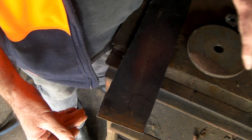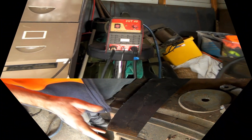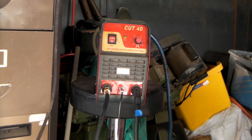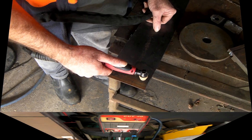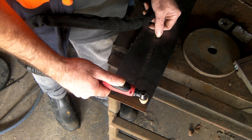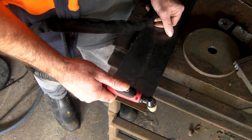You might find we have difficulties with three quarter inch, bearing in mind we're only using little machines designed for the home workshop — you've got to compare apples with apples. So the machine I'm using for the demo is a Cut 40. They have a lot of them that cut 50 now, which I'd buy — but I've had this one for a couple of years. A Cut 50 is going to get about 10% more power than what I'm showing. The cheapest ones online are 50 amp now, so that's all pretty good.